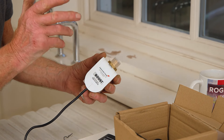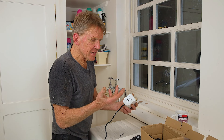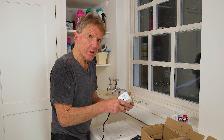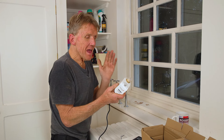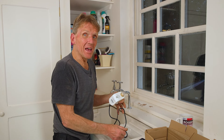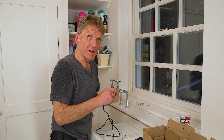The figure you'll be looking for is 1.2 litres a minute. So if it's an electric shower or something like that, just check what you've actually got going through it. Then you can fit the TapBoost to the supply line and it will increase the flow.